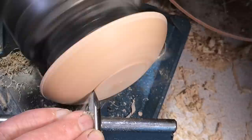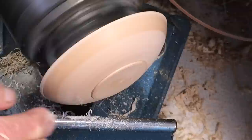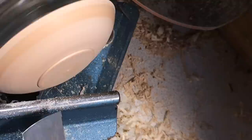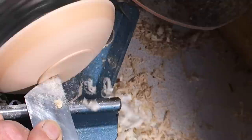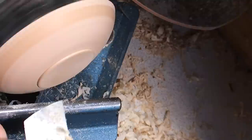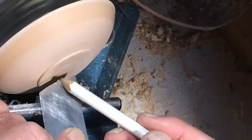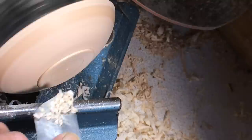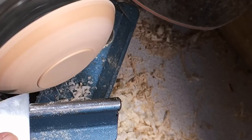I'm going to take that away the easy way - with a square end scraper. This is the skewed - it's actually a shear scraper with the rounded side, but I'm going to use it flat on the rest here. It's tilted down very slightly. It's always important when you're on a flat surface like this: the angle between the top of the tool and the surface you're cutting has to be less than 90 degrees - what they call the negative rake. You don't need a special negative rake scraper to do this.